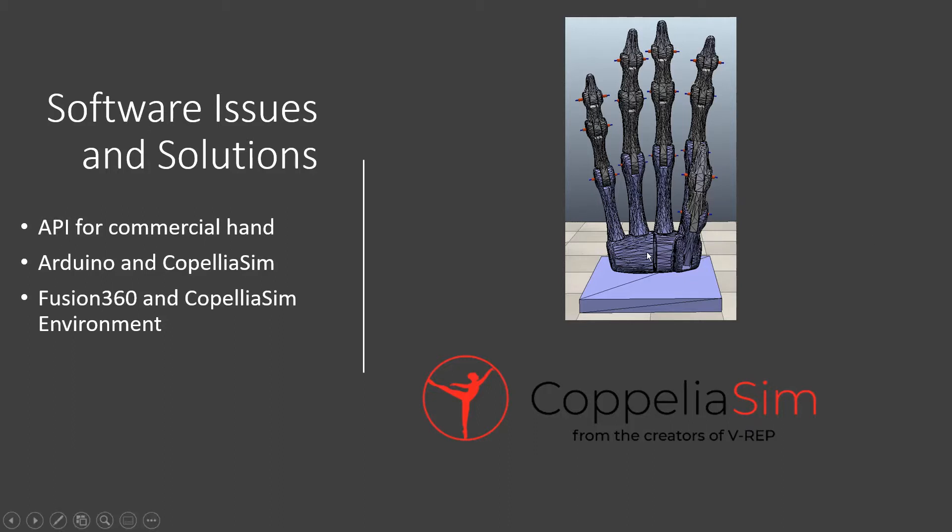The chronological start to problems with the project was finding a suitable model for the simulated hand. There weren't any example models within the simulation software with five fingers, so the options were to find an appropriate model online using STL files or to build the hand model manually in Fusion 360. A viable anthropomorphic hand was found online and converted into a mesh, but the complexity of the mesh led to ongoing issues with the joints and general simulation speed. It also made it difficult to create an accurate kinematic model and find the Denavit-Hartenberg parameters, which could have enabled calculation of the manipulator configuration for a desired end-effector location. Once the model and communications were sorted, programming the hand took time while learning to code within the CoppeliaSim child script writer.